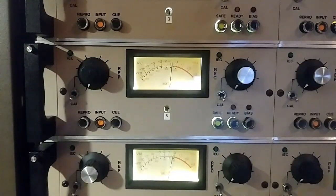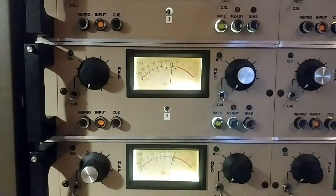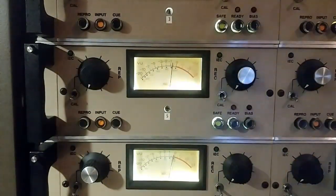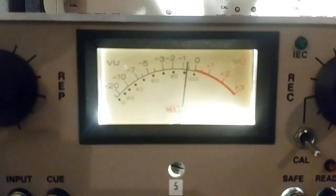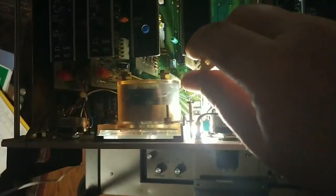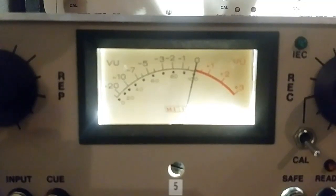The input — I have it set to input right there, so that's metering what's coming in. It's a little low. I know I'm sending it out because I looked at the VU meter of what the output is over there. So what I'm going to do is open up this drawer — there's a little trim pot right down here, right behind the VU, usually blue-ish — and just trim that so the VU reads zero.